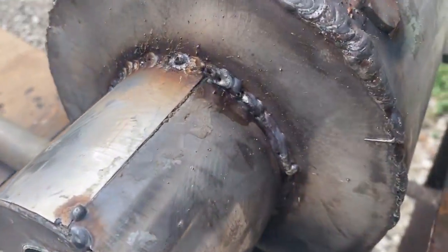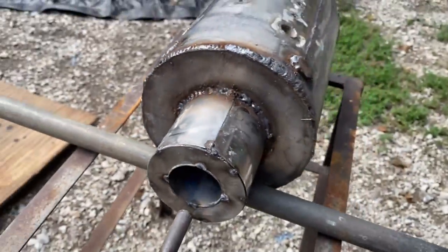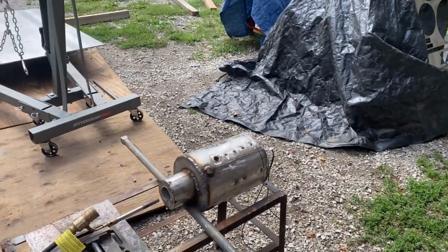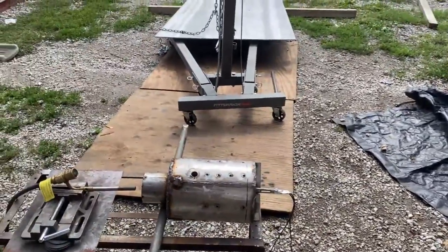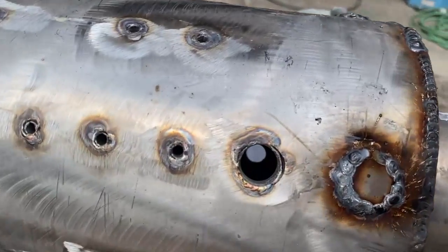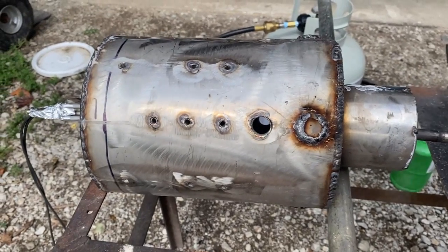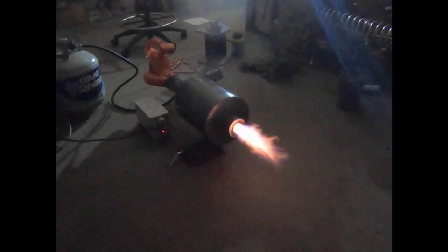What we have here is a concrete refractory-lined can liner, and I'm boiling the water out of it right now because I was trying to weld it together and you can see my welds were blowing up on me — see those cavitation holes. So right now I'm just boiling off the residual moisture from the refractory. It's a one-inch refractory can liner shrouded in stainless steel, and my welding got all messed up from the moisture, so we're drying it out before I proceed.